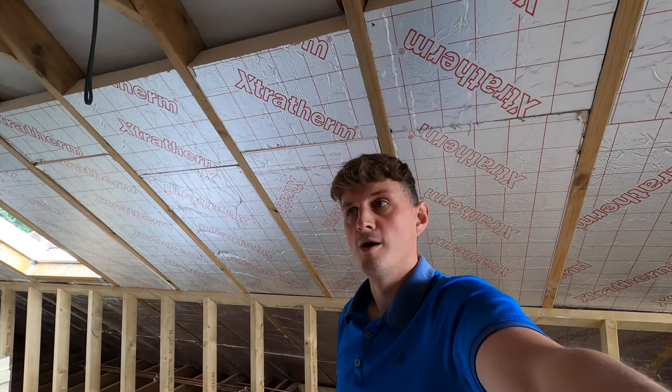Coming through to the bathroom, you can see again the different layers. So we have obviously insulated in between the rafters, which you can see here. These will all be loose because again the plumber has to get back here to run pipes for a towel rail and a bath here. So here's the 50 mil in between the ashlar wall. Here's the 20 mil that will eventually go over the top once these are in. 20 mil goes over the top, and then plasterboard will obviously be fixed on after that.